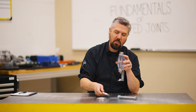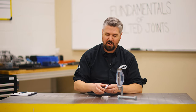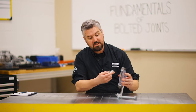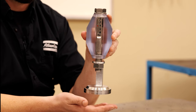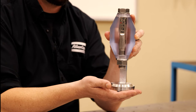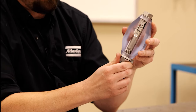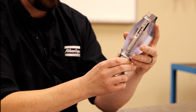Now what happens when we overload this joint? Let's say our product gets out into the market and gets abused, and we double the service load. If we've only tightened to two newtons of force, we have a situation again where we're seeing the service load directly affect the load in the bolt — the service load goes up and down, and the load in the bolt goes up and down. So it's really important to tighten to a value that's greater than the joint will ever see when it gets out and is being used.